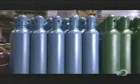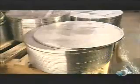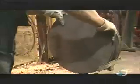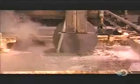These cylinders are made out of chromoly, a steel alloy containing chromium and molybdenum. They start with discs that have already been heat-treated at 1300 degrees Fahrenheit for 36 hours. Now they go into the first of 5 hot chemical baths that will help the metal flex.